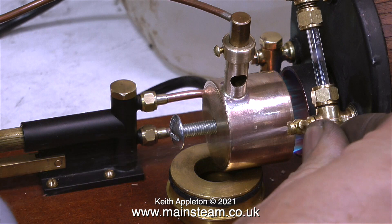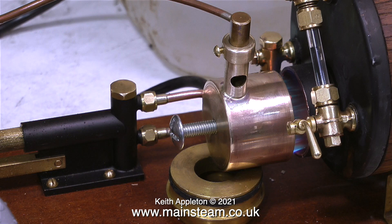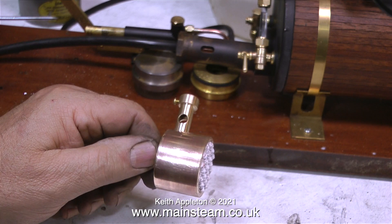While I'm waiting for the boiler to raise steam, I'm just playing with my draincock. This draincock is very good — it doesn't dribble at all. I'm presuming that you've watched the episode about dribbling draincocks. And guess what, the carbon monoxide alarm is going off, and this is probably due to the fact that I tried a few different jets out in the ceramic burner, most of which were wrong, and this obviously created some carbon monoxide.